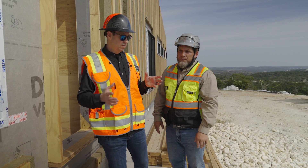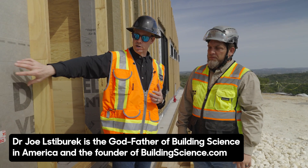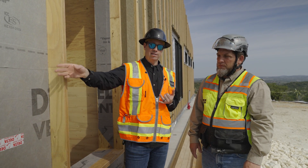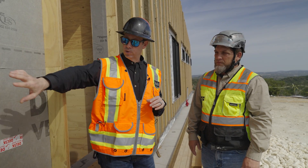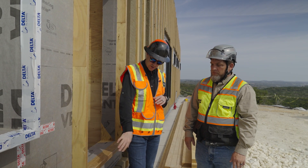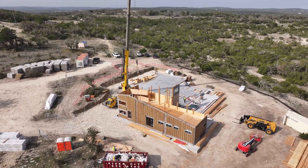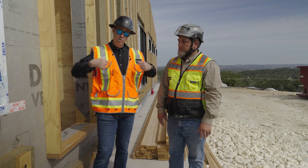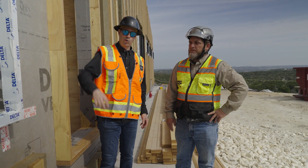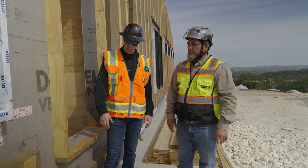This is a perfect wall style, meaning all the insulation is outboard of our WRB and our air barrier. This peel-and-stick Delta Vent SA is stopping air from blowing into the building and is also our last line of defense for water on the building. We're using all Dorken accessories: the blue Delta flashing, the red tape which is Delta Multiband. We've also taped between the panel and the concrete foundation at the bottom. As Joe Lstiburek says: if you were cold, would you stuff insulation between your ribs or would you put a big coat on? That's what we've done — we put a good raincoat on. This is our Gore-Tex jacket so to speak, and then outboard of that we put our goose down coat, which is what our rock wool comfort board is doing.